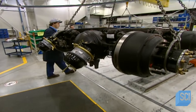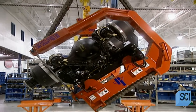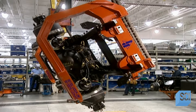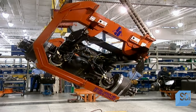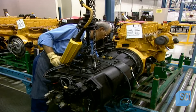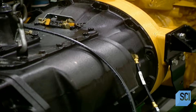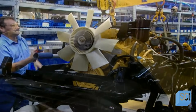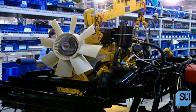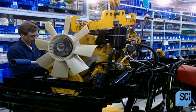To facilitate mounting, everything is assembled upside down. With an overhead crane capable of lifting a 26,000-pound load, they then turn the part right side up. Next, the motor propulsion elements: the transmission is bolted to the motor, and the motor propulsion elements — comprising the clutch and transmission — are installed at the front end of the truck chassis.